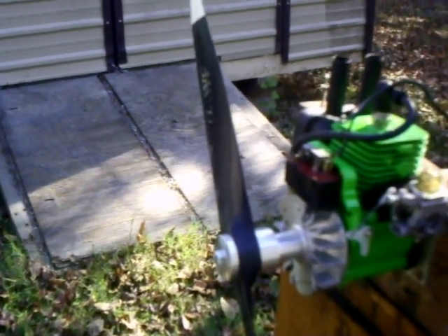I completely disassembled it and trimmed it down. Made an aircraft aluminum back plate, quarter inch, with the bolt hole countersunk so it would mount flush through your firewall — you can see it there. Trimmed the flywheel down and made a 6061 T6 aluminum propeller hub, tapered propeller washer, and a new prop bolt.